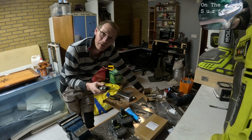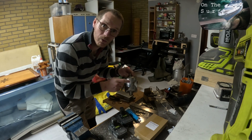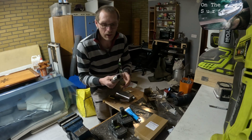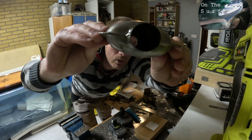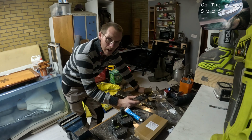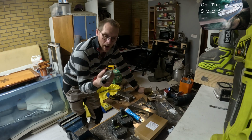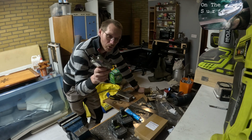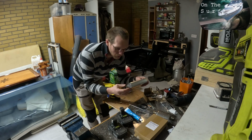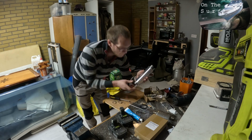One that's S-type, that basically means the pipe in here goes like that, and it's full of holes, really good in reducing the sound. And then you have this kind that's straight through. This doesn't do much on reducing the noise. So I'm not gonna use this, at least not as exhaust silencer. So I ordered this instead. So now it's time to seal this up.